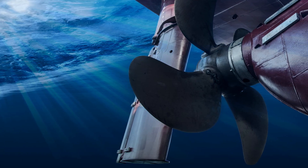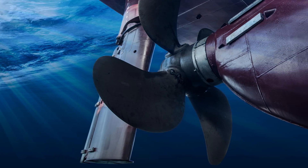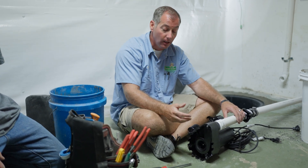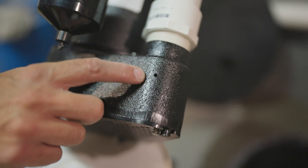We have to give the air somewhere to escape so the impeller can be surrounded by water — once it's surrounded by water, it does really well. A good analogy is a boat: boats have propellers, and this is an impeller. A propeller pushes water; an impeller pulls water. You would never fire up a boat motor in your house to move air around — they're great at moving water but not good at moving air. Same thing here.